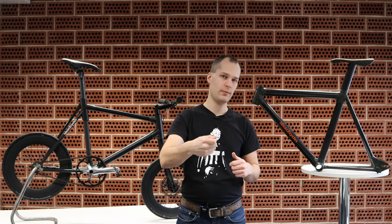In this video I will show you how we got from making frames like this to making frames like this. Over here you see a frame that is made from carbon fiber tubes and the joints are made by wrapping carbon fiber tape around the joints. We don't use carbon fiber tow because if you think about the center plane and the loads passing through the center plane of the bicycle, if you're using carbon fiber tow the fibers at the center plane are perpendicular to your load direction, and that's not how composite materials work. So we use a 0/90 tape and we wrap the joints by wetting the tape in epoxy, and for curing we wrap the joint in peel ply tape, and that way we achieve compression. Excess resin is bled out and we get a nice compact laminate as a result, and the peel ply tape is easy to remove afterwards.